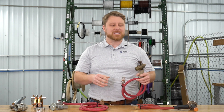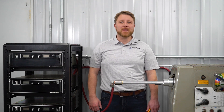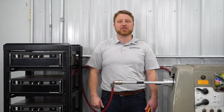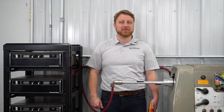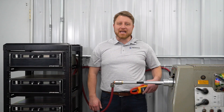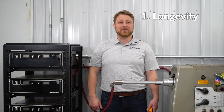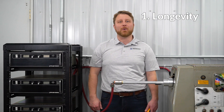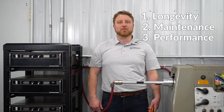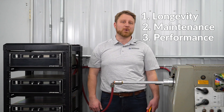Now that you've seen the different types of rotary grounds we'll be testing today, let's get started. To show you how these different types of rotary grounds work and perform, we'll be using a high-current DC power supply and a rotating shaft to replicate the current flow which a typical high-current rotary application might see. We'll also be using a Fluke digital clamp meter to measure the fluctuations in amperage during rotation. There are three main attributes by which a rotary ground can be characterized: the longevity or lifetime before needing replacement or rebuild, the maintenance frequency required throughout its use, and the electrical performance in its ability to rotate without changes in resistance resulting in varying amounts of current the workpiece sees.